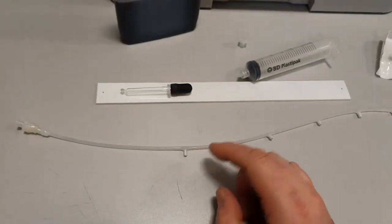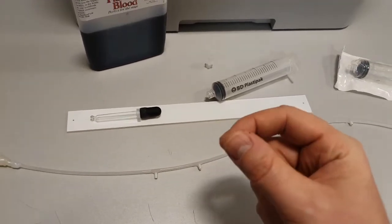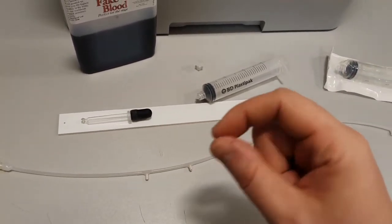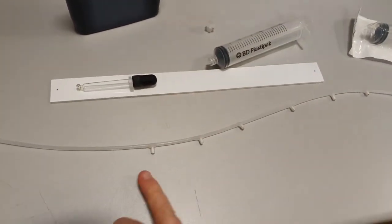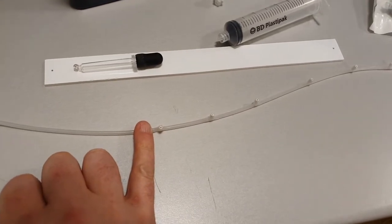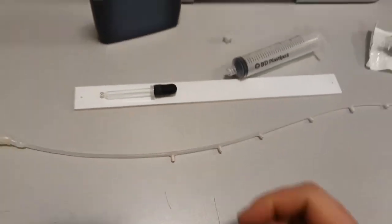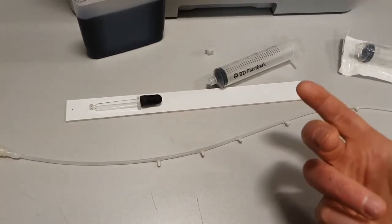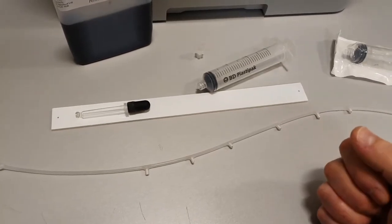What that is, I had some ceramic halogen light fittings. Now, light fittings, especially halogen ones, tend to get super hot. So the wire that you attach it to the light circuit with, the light switch, has this really thick thermo shielding for the wire. Because obviously, if you're wiring up lights, this is for my bathroom, and the halogen lights, you don't want it to get so hot that it melts through the wire and shorts out.